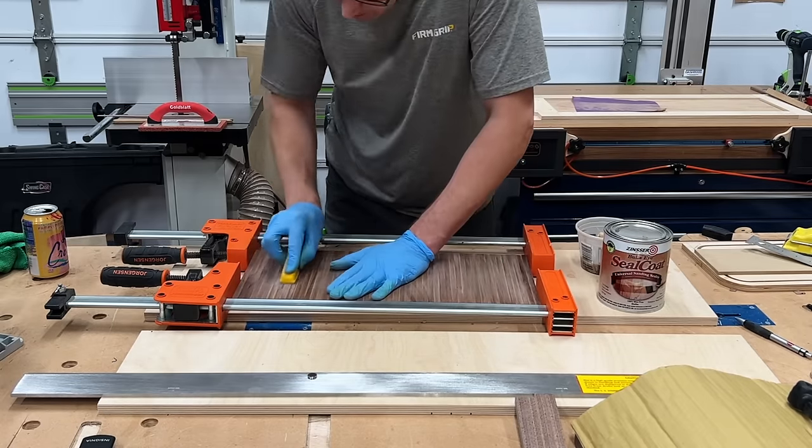That victory was short-lived as I had to turn the doors over face-up so I could sand everything and start inlaying my design with the Shaper Origin. So the next project was to extend my work surface so I could lay down enough domino tape for the Shaper Origin to have an adequate workspace. Everything had to be nice and level with the top of my tambour — my tambours were slightly proud of my jig, but now my jig and the extended work surface needs to be flush with it. Once that was done, I could lay down my domino tape, establish my new Shaper work area, load my design into the Shaper, and drop it in. I had set a couple of pieces of tape down so I could lay out exactly where this would be perfectly square to my tambour.